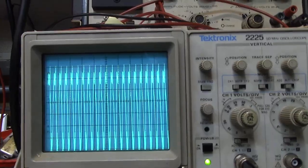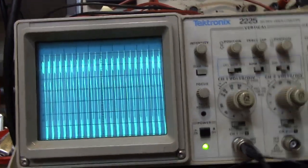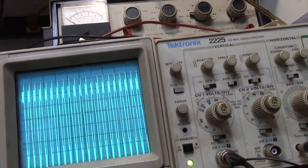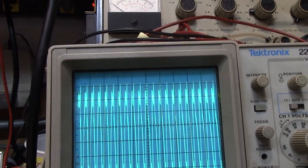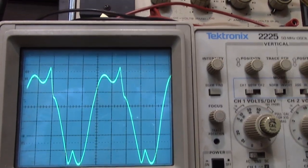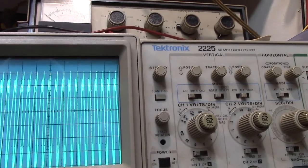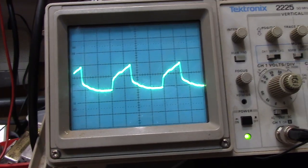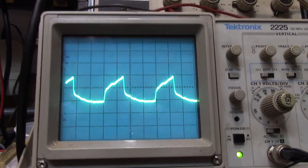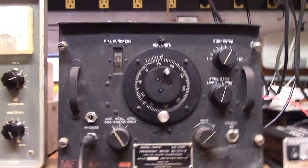This is the oscillation on the high setting. You see it has a lot of harmonic value right there. That's just the oscillator by itself. That's the oscillator heterodyne mix, and this is the crystal by itself. Even the crystal has a lot of harmonic value, which is exactly what you want — and that tank circuit was built for that purpose. This is the low band, and this is the high band showing lots of harmonic. So when I went from tube to transistor it kept all its harmonic value.